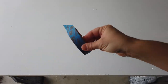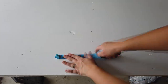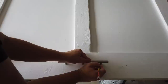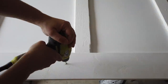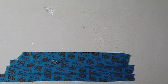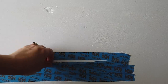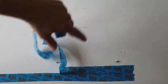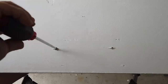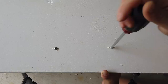Once the paint dried, it was time to install the handle on the front of the door. But first, on the back of the door where the handle is going to come out, I applied some blue painters tape — that's going to help prevent the back part from splitting too much when I drill through from the front. Peeling off the tape, it actually did work; it still split the wood, but not as badly as it could have. Then I just went ahead and installed the handle as normal.